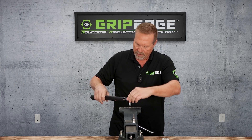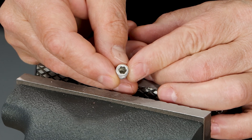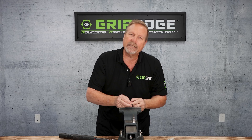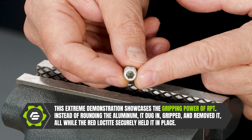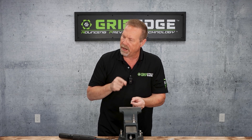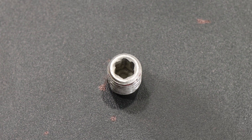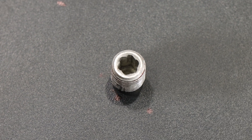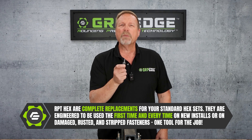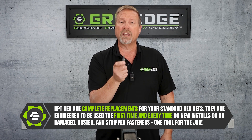I'm gonna have to use the vise to remove the tool from this bit — it's super soft. Let's back it off and you can see down in that cavity how our tool actually made its indentation into that soft metal. The RPT pulls that pressure inward, which you can clearly see by the bite print of this bolt — it doesn't push to the outside corners like a conventional hex. That's why you can get so much torque on a good fastener with no damage. You can see the indentation of that tool, how it bit in, and you can see the rotation and the sweep as it pulls that pressure inward. Remember, you can put up to 50 percent more torque on an undamaged fastener with no damage whatsoever, and up to 400 percent more torque on a damaged or compromised fastener than a standard conventional hex tool will allow.